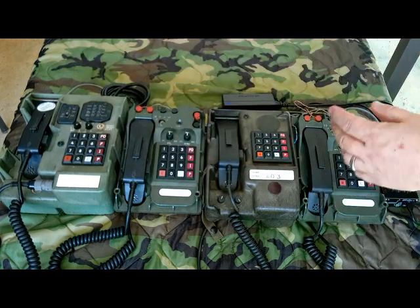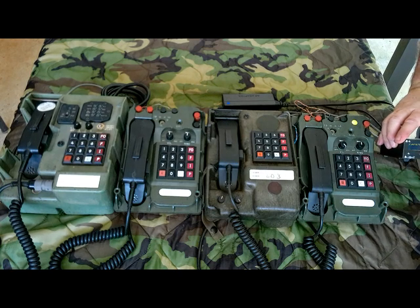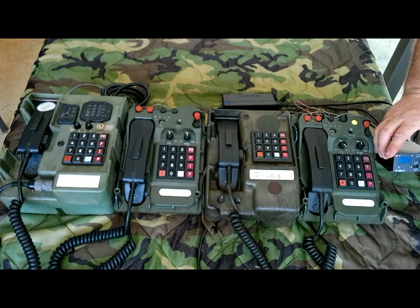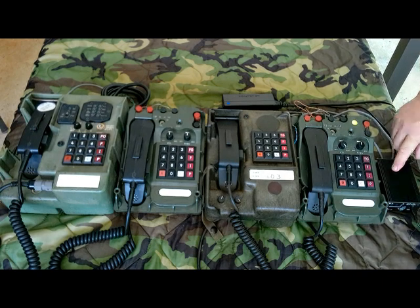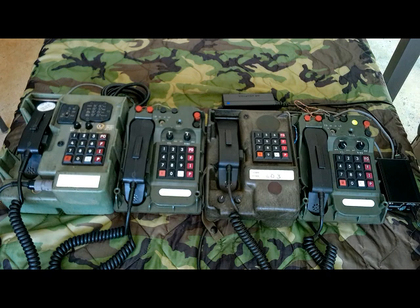So what we're going to do is some dialing to see how this works. This box right here is basically a reverse-engineered switchboard that will run DNVT. This connection right here provides USB power for the board inside, and I actually have a 48-volt power supply plugged into the back that provides the common battery and the ringing voltage to make the phones work.